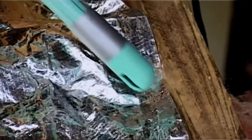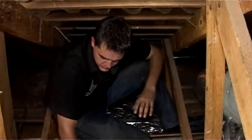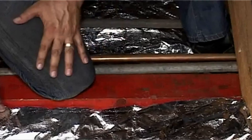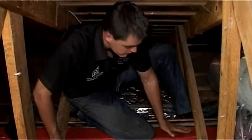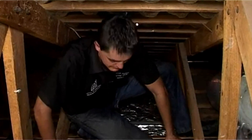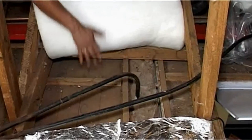Using the broomstick is very effective to get the product right into the corner. We're now going to do the section on installing on an existing ceiling without insulation. What's also important is identifying the roof rafters — we've actually painted them red so when you get out of the roof you can visually quite easily see if you've missed one.